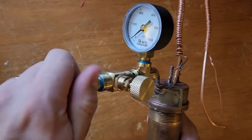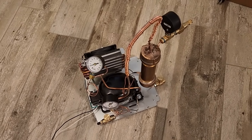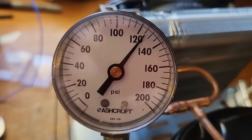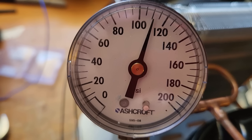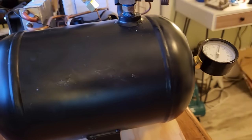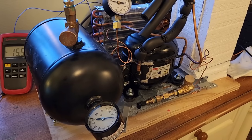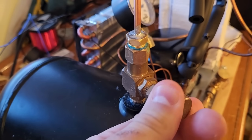Here's the assembly rigged back up to the ice maker system. After spending a good 15 minutes vacuuming out the system, I backfilled it with propane and let it run. After a few minutes, the pipe started icing up. The system works, but when I try to add more refrigerant, the motor stalls out after a second. This is kind of expected since the compressor was designed for butane or R600, which condenses at a very low pressure. To remedy this, I installed a 1 gallon buffer tank on the low pressure side of the system. This added a lot of bulk, but allowed me to add a significant amount of refrigerant to the system while keeping the static charge pressure low enough that the motor would start up without any problems. I also added a valve to this buffer tank so I could adjust the amount of refrigerant admitted to the system for a given run.